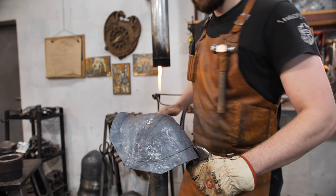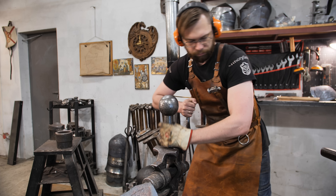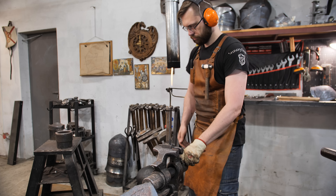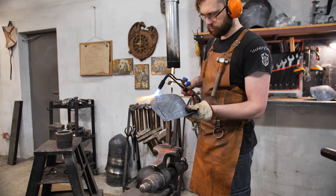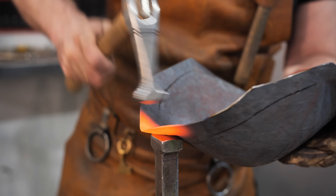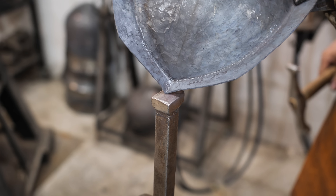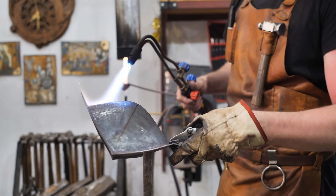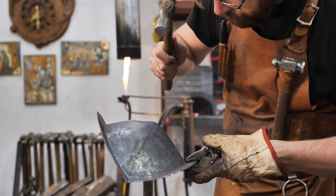Now I'm bending the edges. A couple more slaps and the shoulders are done. But I understand that a lot of my subscribers have not yet evolved to reptilians, so I'm showing how a regular human can do it. I'm using a device with a small flat space, heating up the edge so that the cold metal starts on the bend line, then hammering with a regular hammer. After I've done that on both shoulders, I can straighten the edges on the central rib using the raising method, which can only be done with hot steel.